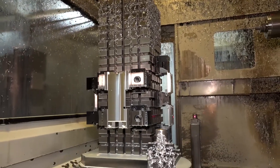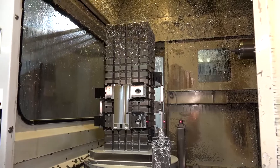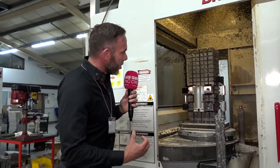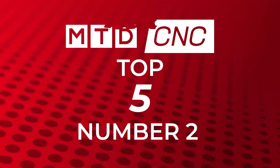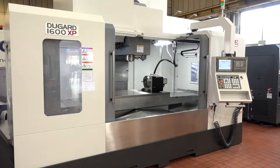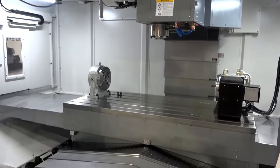You can hold up to about 200 wide on this cube, but it's ideal for your smaller components, getting three-faced machining, and of course it's very versatile. You can clamp up and down or side to side. Because it's a cast iron frame with roller guide ways, it weighs in at 12 and a half tonne.